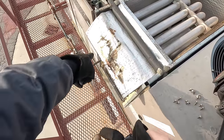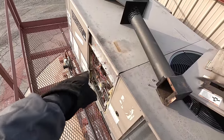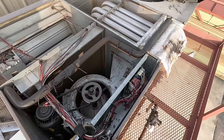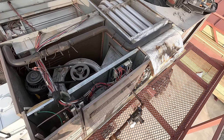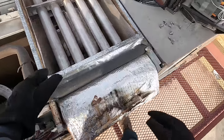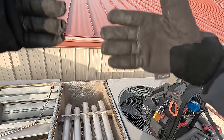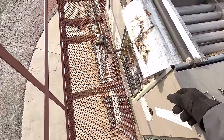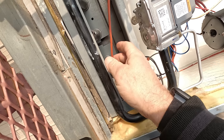It's only 31 degrees up here, but that freaking wind is making it feel a lot colder. One heat exchanger was just replaced — I found out it was this one. Some installer didn't even convert them to propane, so our guy had to convert it to propane after the fact. This one might just be a pilot issue. Honestly, this is piss-poor engineering — these extension pieces are probably why they added them. This is how I judge equipment: whether or not it's got a good design to work on.